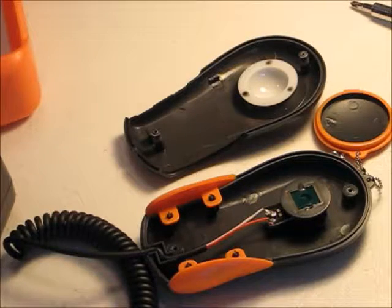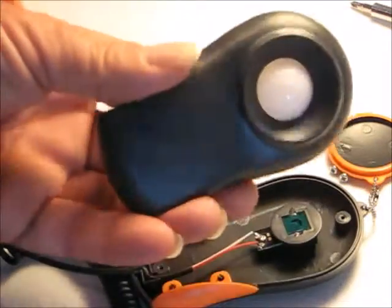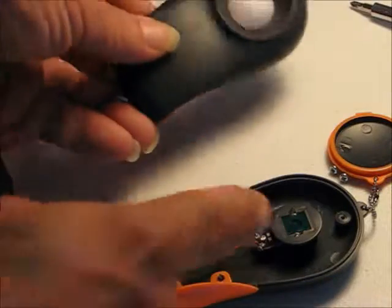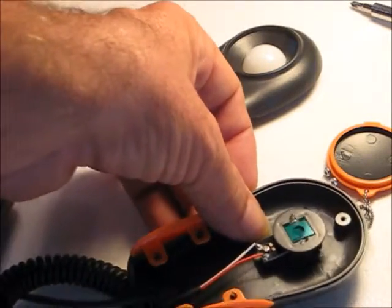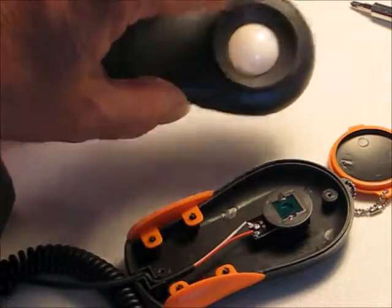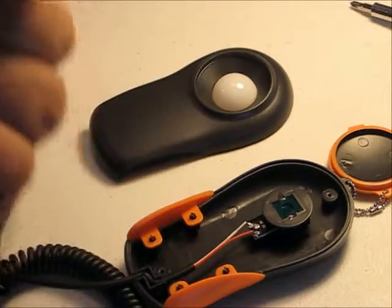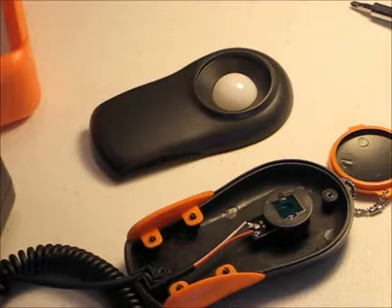Now that we have the device taken apart, we've got our anti-diffuser. It's actually going to try and gather horizontal foot candles — light that's coming straight onto the thing — and concentrate it onto this little pickup, which has a small green piece of optical film. Underneath it, there's a little pickup. The idea is that between the optical physics of this critter and the film, it's going to attempt to give this a range that approximates visible light to human beings. We can see we have two conductors: a red and a white.